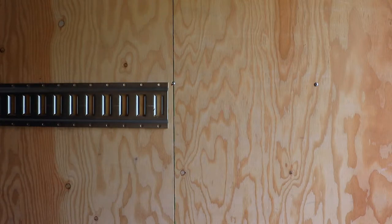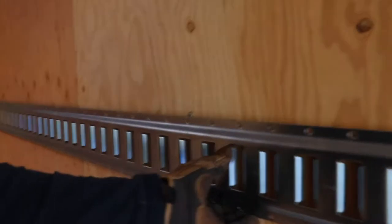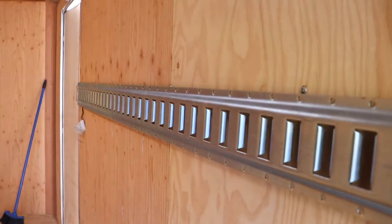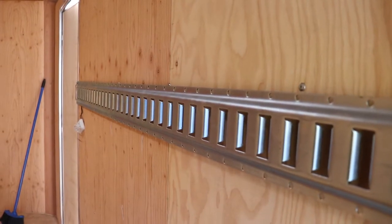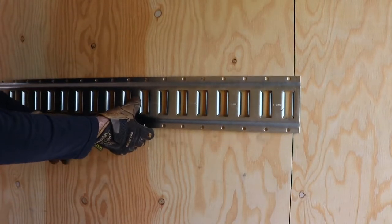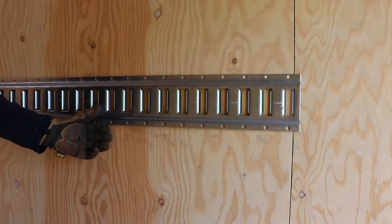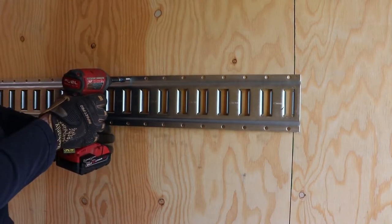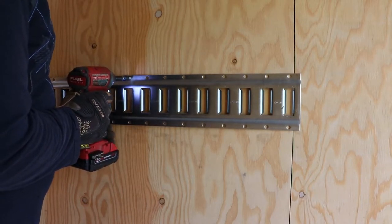If I have to, I'll use washers just to capture the end here — I might just need to do it on the front. I'm going to basically disconnect at the beginning and hang it from the second hole that I already had drilled initially, then work from there to make sure that the ends are solid. I'm going to try to get it into this stud here — I moved it over a little bit. I'm not sure if the screws are right in the center of the stud or not, so I'll get my height and start drilling through the wood. Yeah, I'm in it.